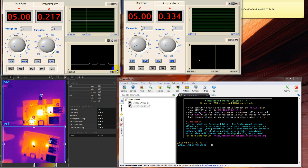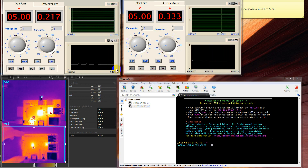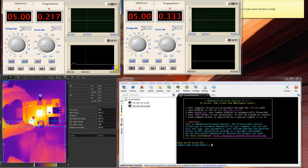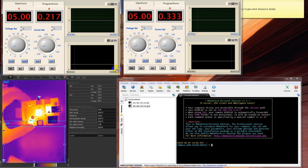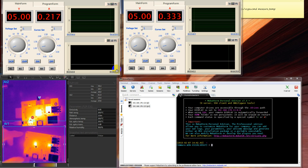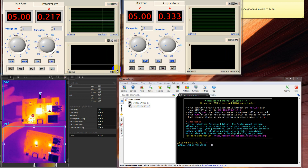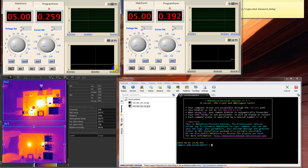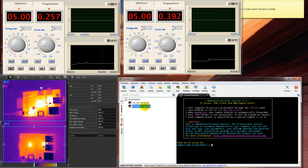Before I reconnect the ethernet cable I also want to attach the HDMI cable to show you what changes it will give. Please watch the current consumption — as you can see it isn't increasing very much on the Raspberry Pi 2. I will attach this and connect it to the old Raspberry Pi — and also there is no significant change in current from the HDMI port. I will put back the ethernet connection to both Raspberry Pis so we can start logging in.